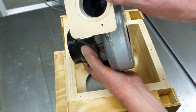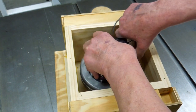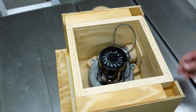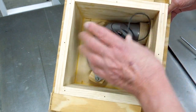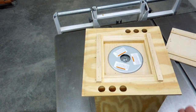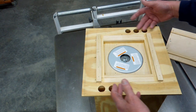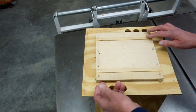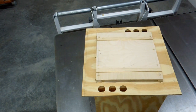The blower has an adapter that I made on the lathe — it just fits on here and drops down into the blower box. These two screws engage with that adapter plate, and then there are three screws that hold the motor in. This is the bottom of the motor box. The air coming into this blower box will have to go through these baffles and come into these holes. There's a cover plate that sits on here, and the air goes into these slots created by this plate. This bottom section will be full of sound deadening material.